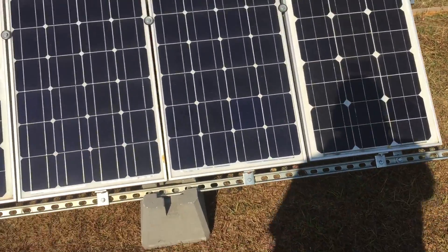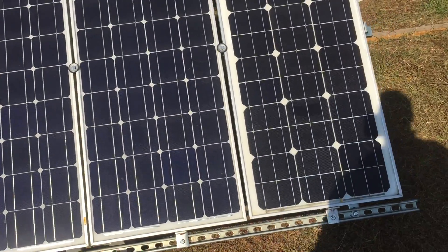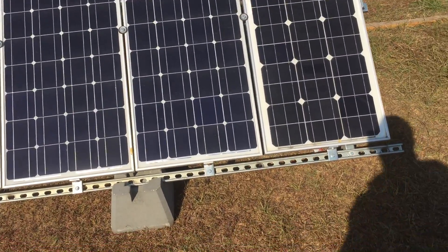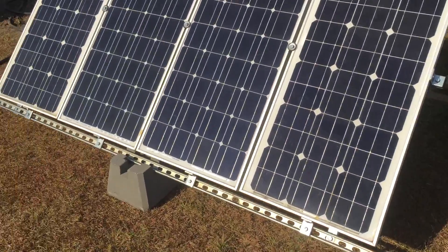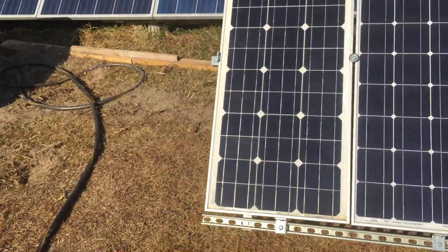The batteries I have say they basically need about 15 amps apiece. That's a good rating for my Trojans and any other battery bank — you want about 15 amps per set to be able to charge, whether it's at 12 volts or 48 volts. If you're set at 48 volts, 15 amps is a good number. Multiply that out and it will tell you your array size needed to charge that battery bank without trickle charging it, or causing a low depth of discharge throughout the day. When I did my sizing I did it based on those numbers and it helped me out.